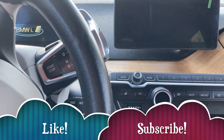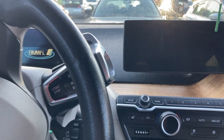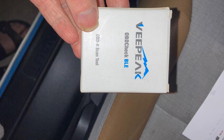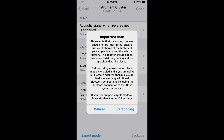Based on that, I think a good episode might be looking at what can be done to activate the reverse alarm or buzzer sound built into the car. I have a VPeak OBD connector that's Bluetooth, to connect to my phone and use with Bimmer code. It plugs in under the dash on the driver's side, and in Bimmer code under the instrument cluster you can see there's an acoustic signal for reversing. I made that active in Bimmer code and uploaded that code change.